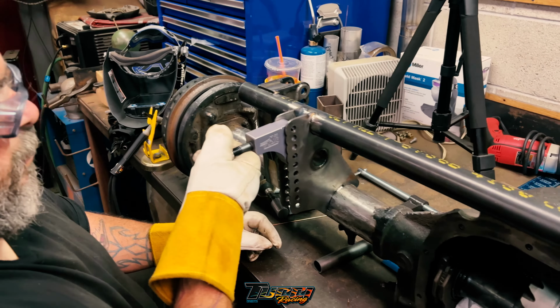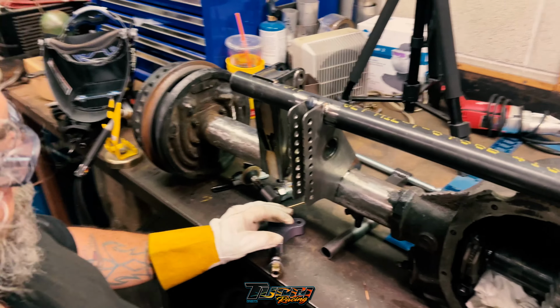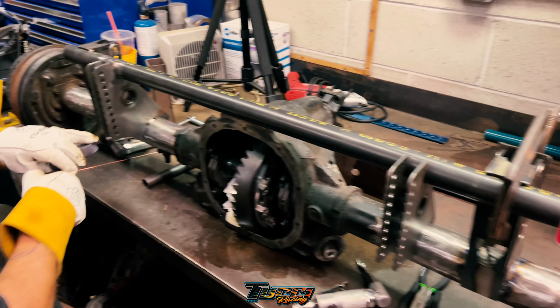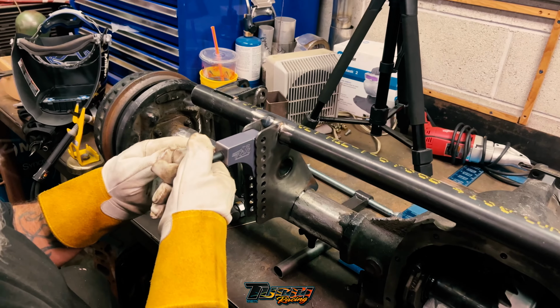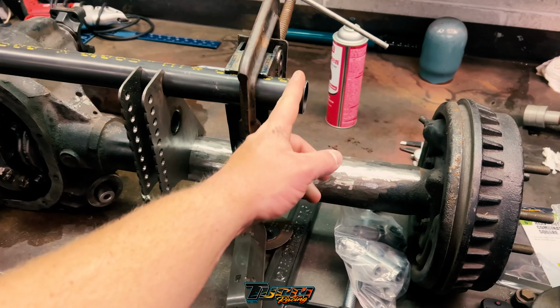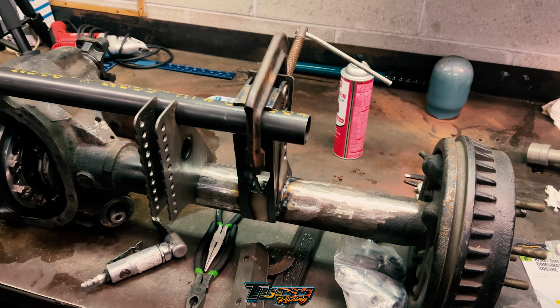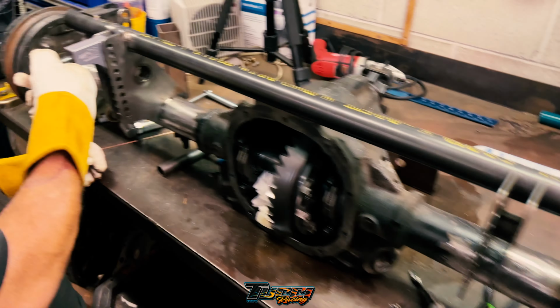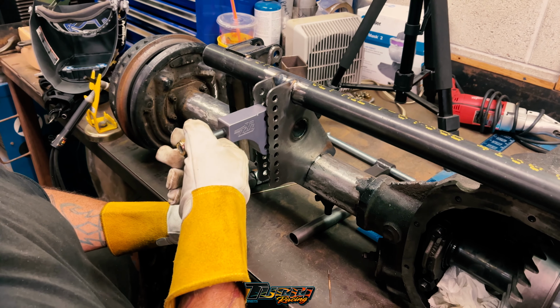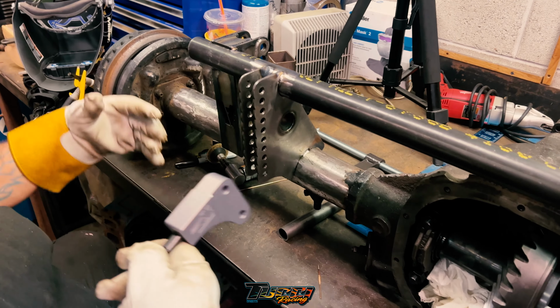All right, so everything is stacked on, and it looks good. Also, we have to cut the bar a little bit, but it's about a quarter of an inch off. But it was already so set up and ready to go, to go through the hassle of taking it all apart, and then measuring it back up, it wasn't worth it. So we'll just have to cut a quarter inch off this side. What we'll do is we'll tighten them up. Then we weld the whole thing. The heat and everything.